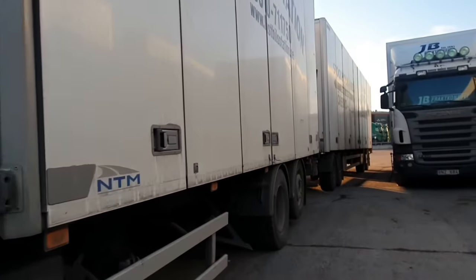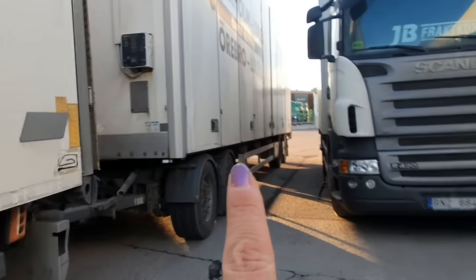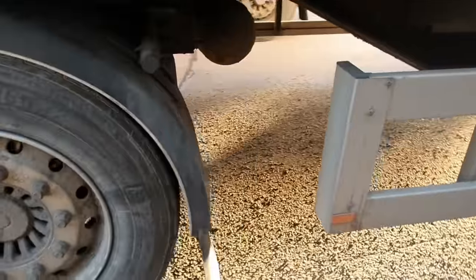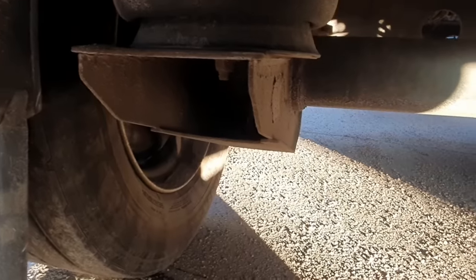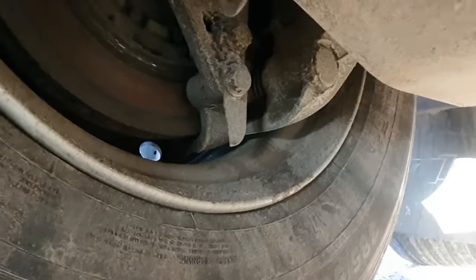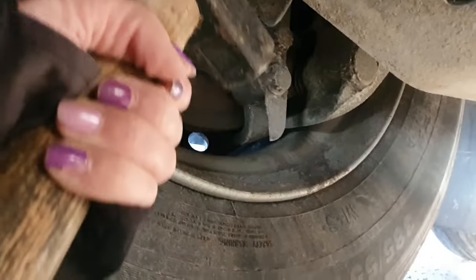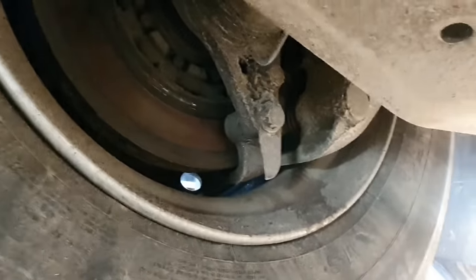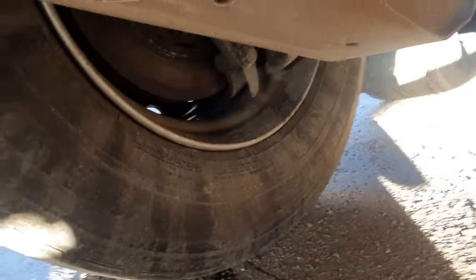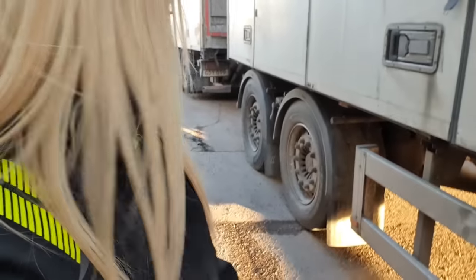I'm going to show you two different things you can do if your disc brake has been freezing. We are going all the way back to the second axle where the disc brake is, and we're going to go in here - it's very very tight underneath. We have the air tank here and there is the disc brake. This is the one you are going to use the hammer or sledgehammer on. You are just going to knock it a little bit to loosen any ice that could be inside the disc brake. Before you go under the wagon with the hammer, you can use it on the outside first. I'm going to show you where you can hit with the hammer so the ice will loosen from the wheel.